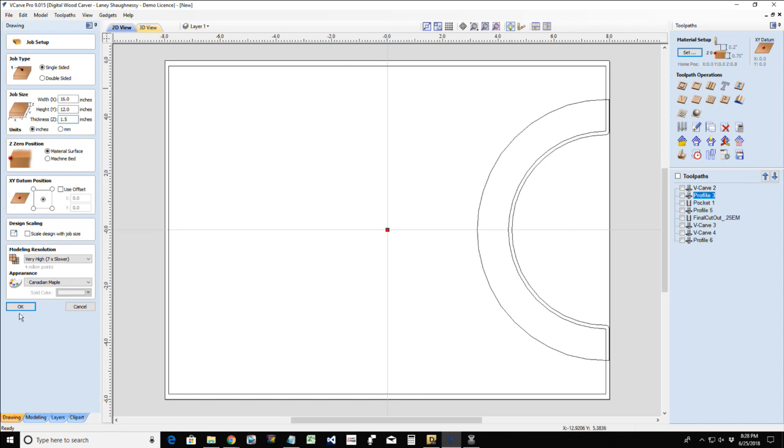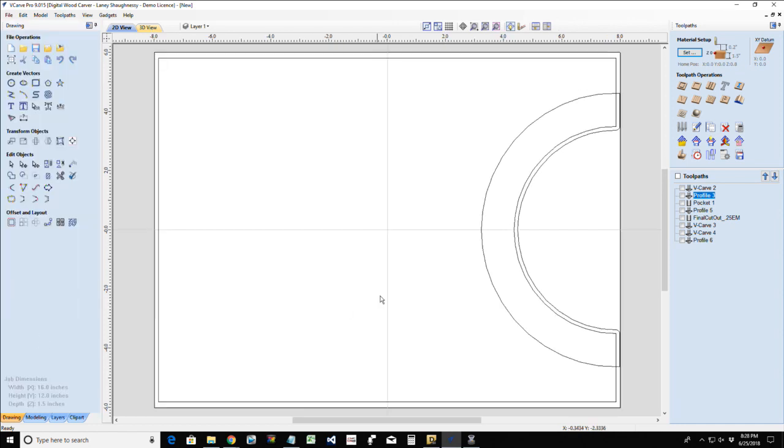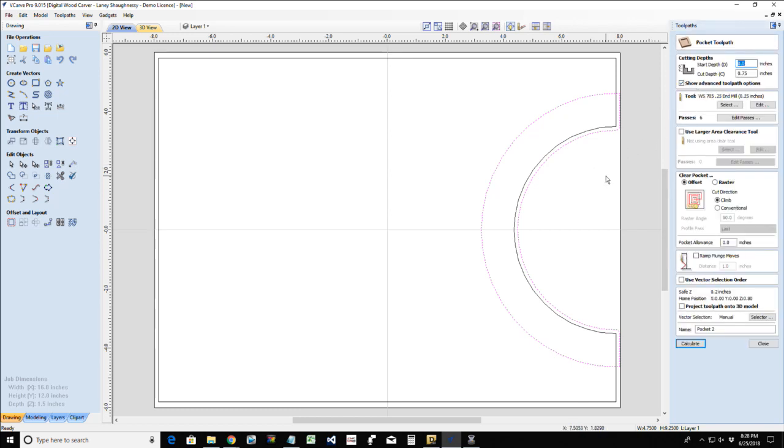1.5 to 2 inches thick, okay? What a nice inch and a half thick piece of material. All right, so with this, for our pocket cut, we are going to cut down, and on this inch and a half thick, I would like to have at least a quarter inch, maybe a half inch of material on the face, the top of this. I don't want a very brittle lip that's hanging over, and you'll see this when we do the actual 3D view.